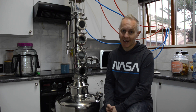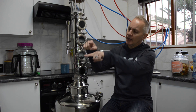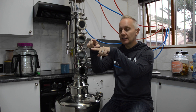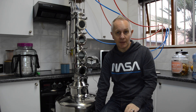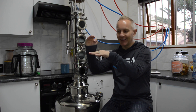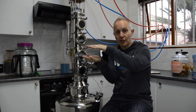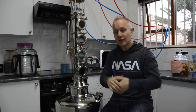You can cause a hell of a mess, or even an explosion. I've seen some really bad videos — even a guy who burned himself because something like that happened. The second reason for me is that my heating element at the bottom is only so high from the base. If I tend to run my still dry with no more liquid over the element, the element can get damaged. So I make sure I have about 10 to 15 litres of bottoms so the element stays submerged and doesn't have a chance of burning out.